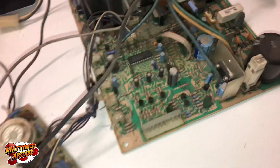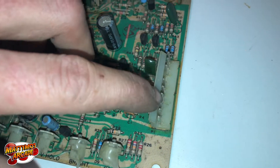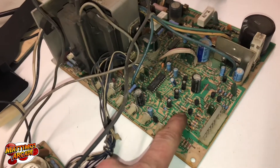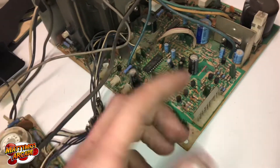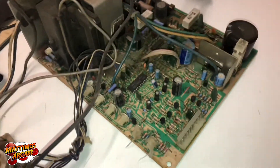Let's see what it is — yeah, 2N3904. That's the technical name. So I assume this one's going to be the red one because our first pin is red. We should have red, green, blue, ground, and then we run our syncs down here — the horizontal and vertical sync. What I'm going to do is swap this out real fast. I'm not going to recap it yet, just do this and see if that fixes the problem. If that's a success, I'll go ahead and cap it, then throw it in Street Fighter and move on.